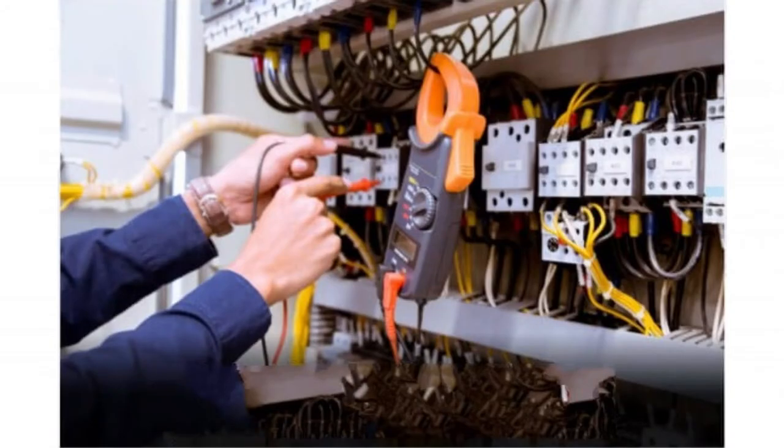And the wire should be selected as per your load. As a general example, for a lighting circuit, the standard wire gauge is 1.5 square mm for phase, neutral and earthing. Similarly, as you move to higher load, the wire gauge increases.